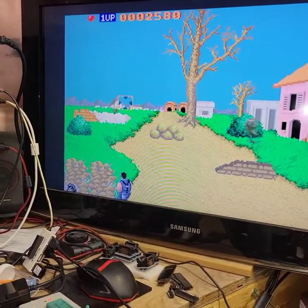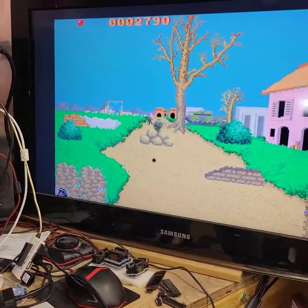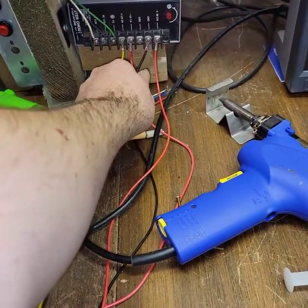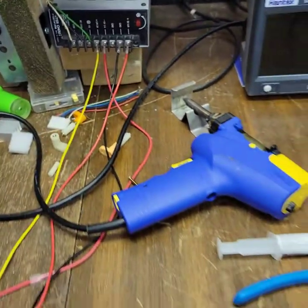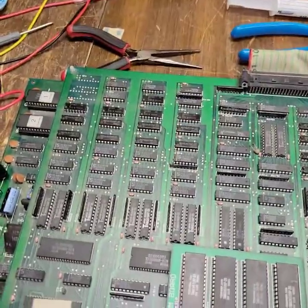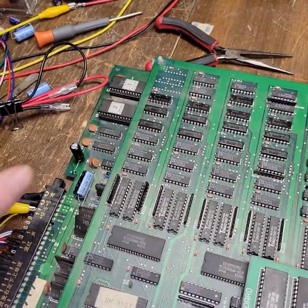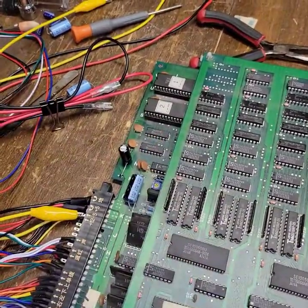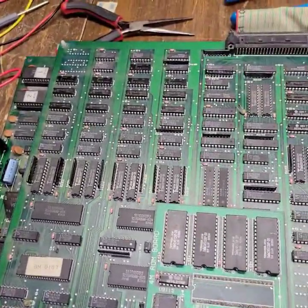I can't move because I don't have the trackball installed, but I'm sure you get it. All right, I think that'll do it for this one. They're not hot, but they're warm and they shouldn't be. The 12 volt rail is fine. Just that one was leaking, this one's leaking — it's across the five. Gotta have steady voltage. Might as well change them right here. Yeah, I think that's gonna be it for this one. Cabal — working.